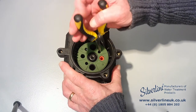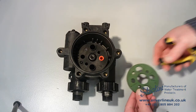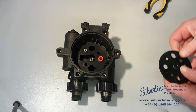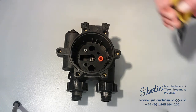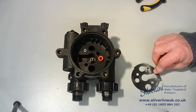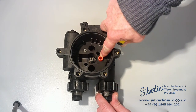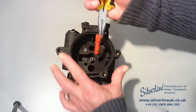The green seal disc can easily be removed with a pair of long nose pliers. Next comes the insert plate and the rubber gasket. This is the injector — this valve is fitted with the red one, but they do come in other colours. And again, that can be removed with a pair of long nose pliers.